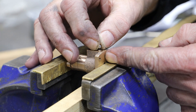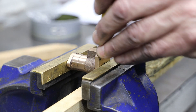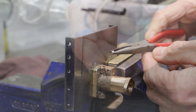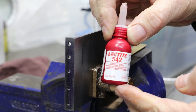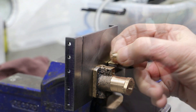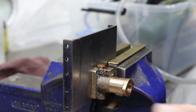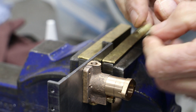For the outlet, this is on the inside of the outlet port. I drop a stainless steel ball into location and, using a punch, give the ball a good solid tap to form the sealing face in the brass. On the inlet side, the ball seat is on the outlet face of the inlet elbow, and again a good strike with a hammer should nicely form the seat. I should say thank you to Bruce for advising that the ball used to form the seat should not be the ball used in the pump. Assembly is quite straightforward — not forgetting to include the balls. To seal the threads I use some Loctite 542. Apparently the amount of float the balls have is quite critical to prevent hunting when the pump is in use, and Don has given a recommended dimension, but I have no idea how I'm going to measure that, so I guess I'm just going to have to suck it and see.